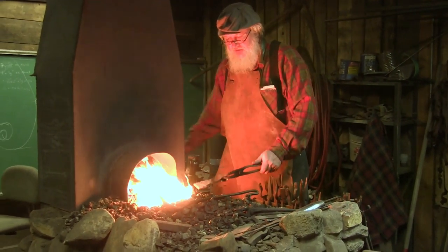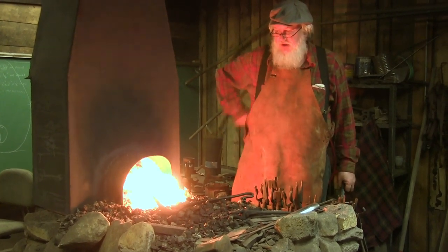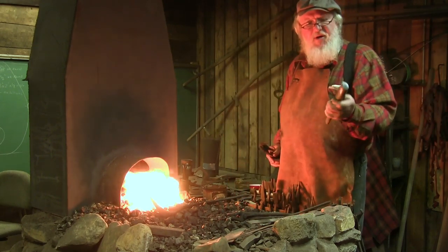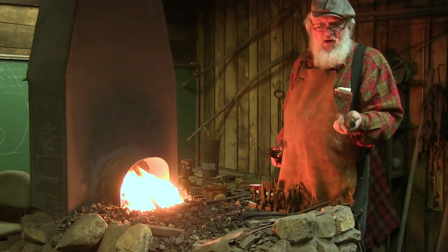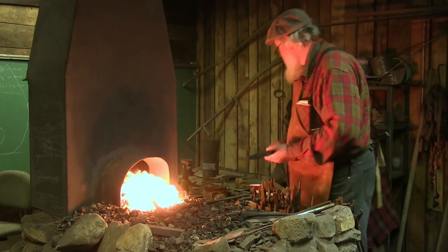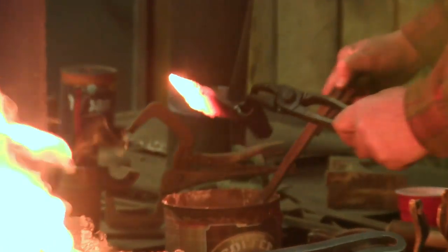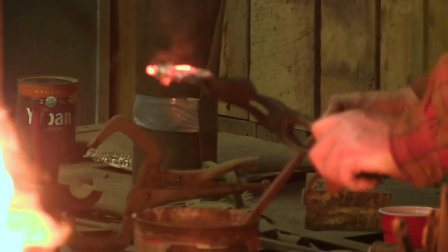I'm going to put this in the fire now. I'm going to bring it up to orange heat like we did the other and add the flux and place it back in, bring it up to weld heat, and make the final forge weld to weld the bit in place. Then we'll heat up the eye — I've got a tomahawk drift here that I purchased at Kane & Sons Custom Hardware. Their website is blacksmithsdepot.com. They're a good resource for tools and equipment for blacksmithing. They sell the drift and they also sell the handle that fits it, so it just makes it a lot easier if you've got the tool with the handle made particularly for that drift. It saves a lot of fidgeting and fitting to get your tomahawk finished out.